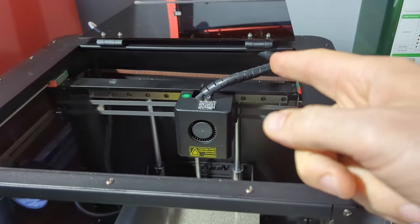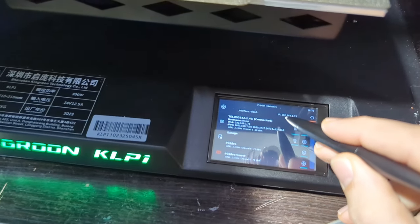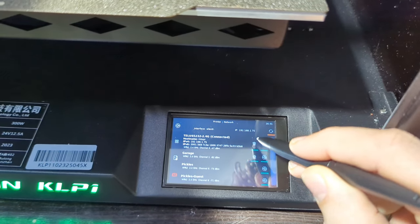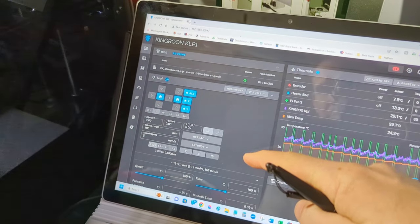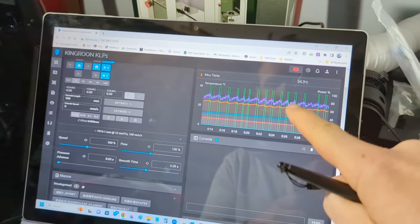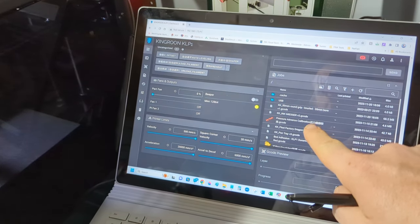They are working on this behind the scenes. One thing I noticed: there's a little touch screen — it's a bit cheesy but it comes with a pen. The main issue has been connectivity. You connect to it via your web browser — just punch in the IP address in Chrome. The IP has changed on me a couple times, but you hit enter and you're connected. You can home all axes, send temperature profiles, monitor the hot end and build plate, and access your files. For those used to Klipper, you know this — but to me coming from just a knob interface, it has been fantastic.